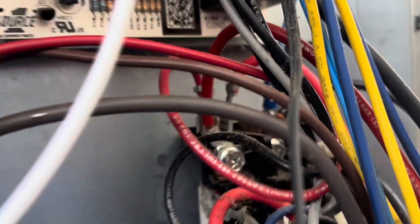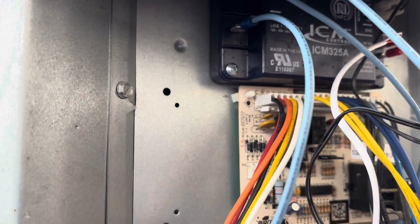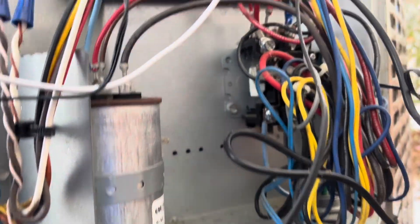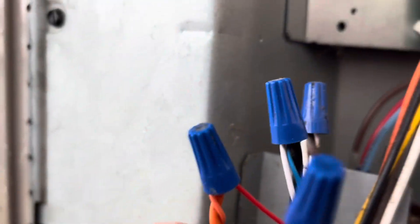I made all these wires up myself. That other wire goes to T2 on your contactor — T2 is the top of your contactor. The final one goes to the relay on our defrost board. So basically we are regulating the speed of our condenser fan before we send it to the defrost relay. Now all we have to do is mount our condenser temperature probe in the condenser.